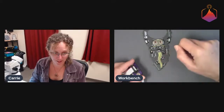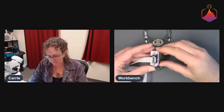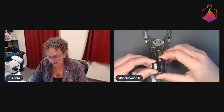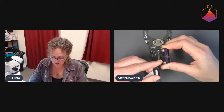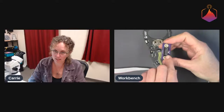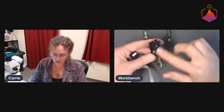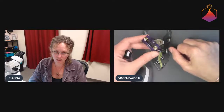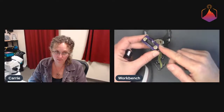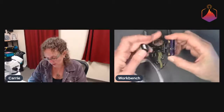We're going to put a pin 1 marker for you on there so that you know which way it is. These guys are keyed, and pin 1 is in this corner right here. We have also denoted pin 1 by making a 45-degree chamfer on one edge of these boards.